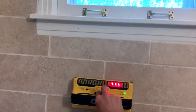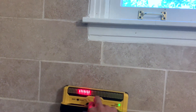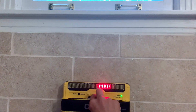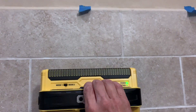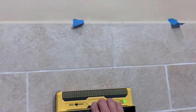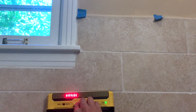It's going to pick up this one I know is there — and there's a little blip in the wall, there it is. That's not a stud, but this one is. Very clear that's a stud, very clear that's a stud. Just to show you — no calibration needed — I'll turn it on in midair and put it against the wall: boom, stud, stud, stud. And that is where that stud is — I marked it on the tile up there, but it's actually behind the trim a little bit.